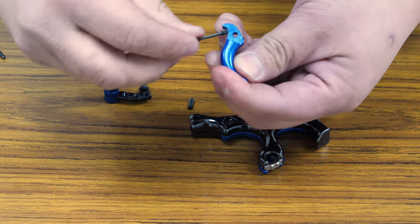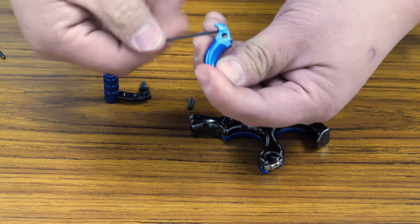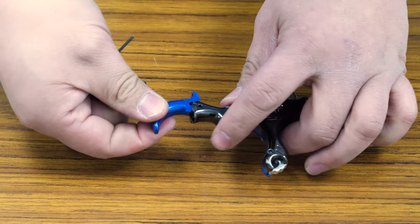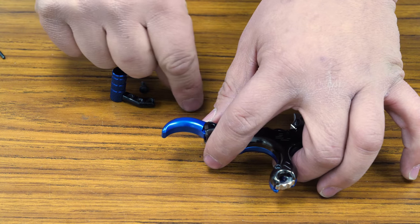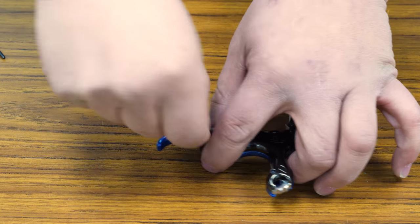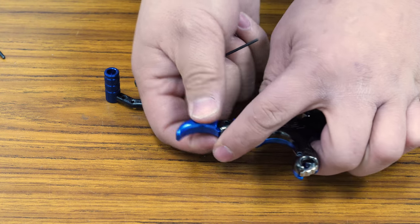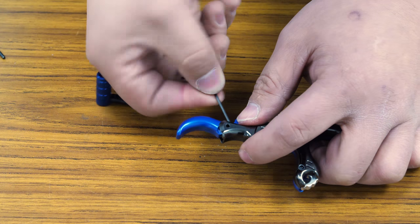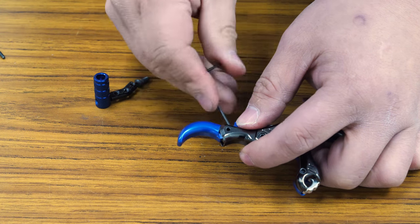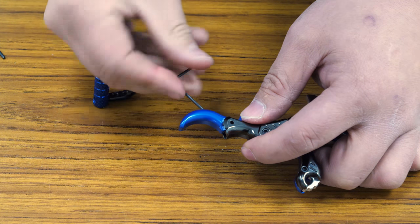I'll show you the reason why you need to do that. Once you get that done, you're going to drop it into the new release and put the pin back in. The reason why you need the two set screws is you can adjust the level of how much this rocks back and forth by just turning the two set screws until you find a balance point where you want this fourth finger to be. If you look carefully, there are also gradient lines on the back here that tell you where you are relative to the angle of this fourth finger.